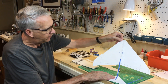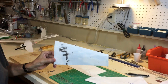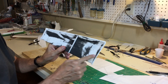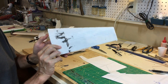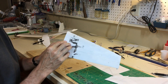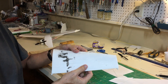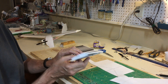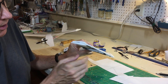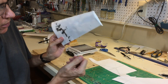Also, the swept wing — I've never made one of those on a foam board. So just as a test, I did this dummy swept wing design. Just like with that model, I've got the foam ribs located here. What I learned is you have creases every quarter of an inch that are 90 degrees to the fuselage side — the root. That seems to work out well as you do the bends around the wing ribs. The wing ribs are just a generic airfoil shape — approximately a Clark Y, which I think is close enough for these types of models.